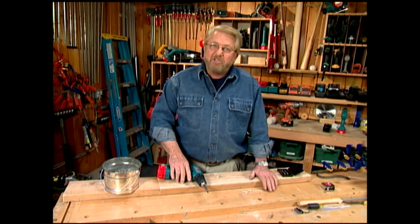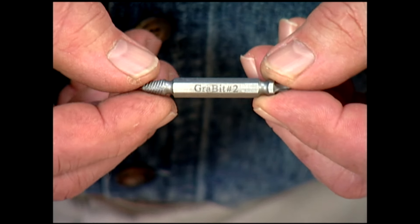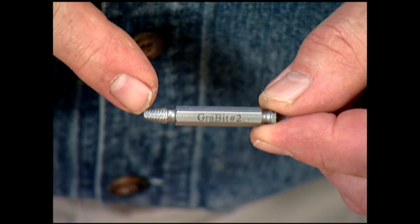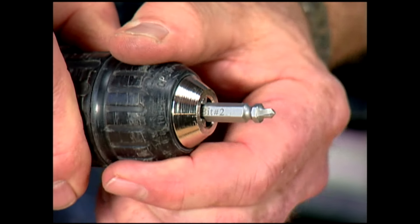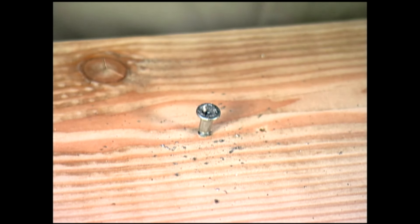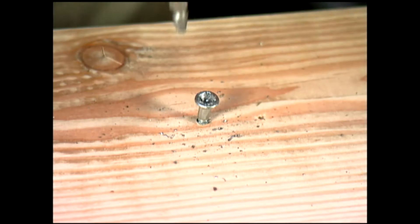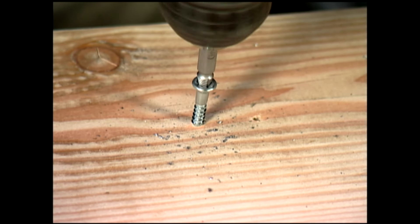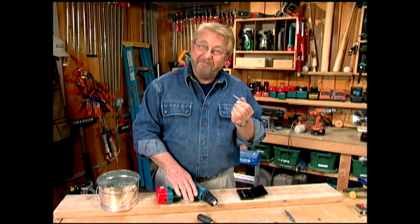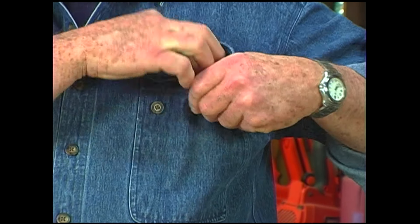There's not much that frustrates me more than a stripped-out screw head — you can't drive it in and you can't back it out. Now there's a solution: a new screw removal tool called a Grabbit. It has two different ends — a reamer on one end and the remover itself on the other. I first load it into my cordless drill with the reamer end out, set the forward/reverse switch to reverse, and apply moderate pressure as the reamer quickly cuts a cone-shaped depression in the screw head. Then I reverse the tool so the remover end protrudes, start the drill slowly in reverse, apply a bit of pressure, and out comes the screw. These come in two sizes — one for large screws and one for small — and with a set of these in your pocket, stripped screw problems are a thing of the past.